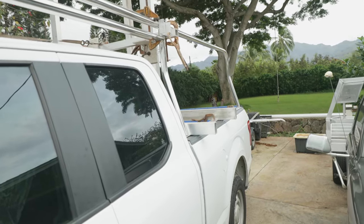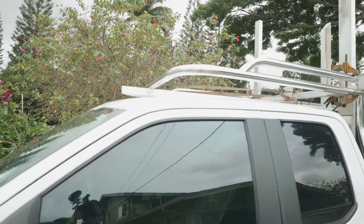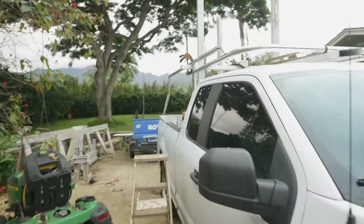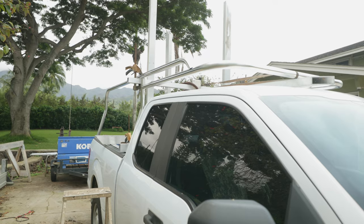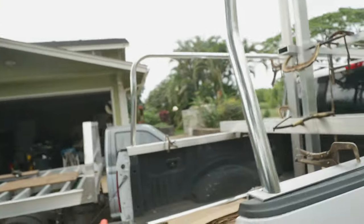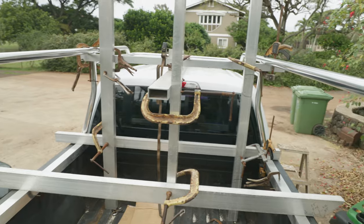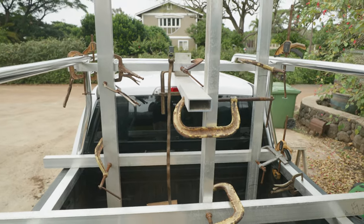Here's the theory: the whole back is bent all out of one piece, and so is the front. This is a one-piece bend — 90 degrees, all the way over to this side, another 90, and tied in right there. It takes a lot to do it like this, but this is for a friend. I built him a rack a bunch of years ago and he wanted another one. I'm TIG welding this — it's all anodized aluminum.